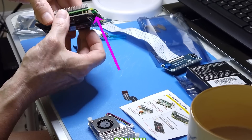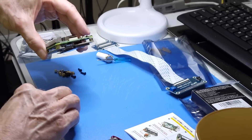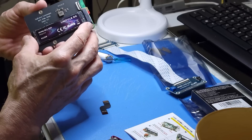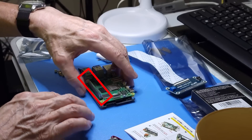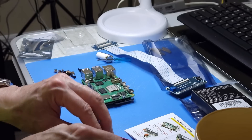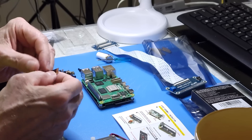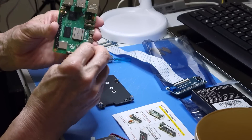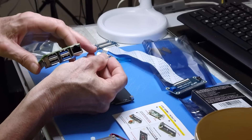This board sits on the bottom of the Raspberry Pi. Notice those two golden standoffs — they're copper standoffs and they touch power on the IO riser. There's an IO riser — I think it's 34 pins — and there are two gold contacts that come up and touch the bottom of the Raspberry Pi 5 board, providing the bottom board with voltage and ground.